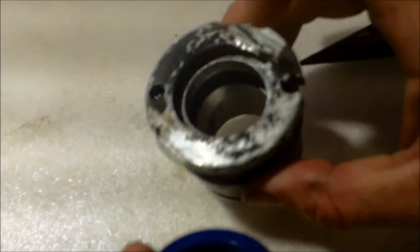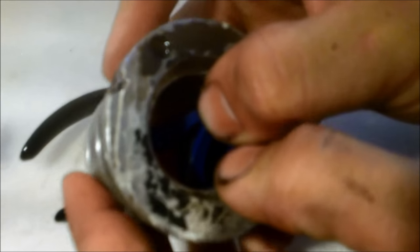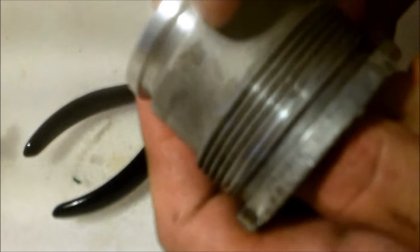We've got to put this ring in here — it has an o-ring and the o-ring goes down inside here. You're going to try to make like a heart shape out of it. You can take your needle nose to work it in. Keep it from ballooning out — you want it into the groove. That's the hardest part. See that last little kink? Work that in with your thumb. I've got all the other washers in now. This one is easy — just snaps in. The hardest one was that inner one as you saw.